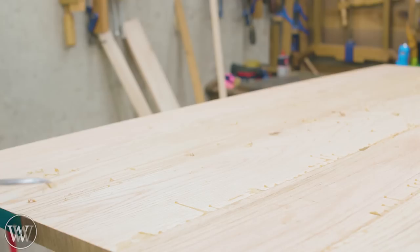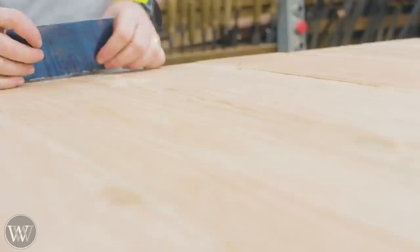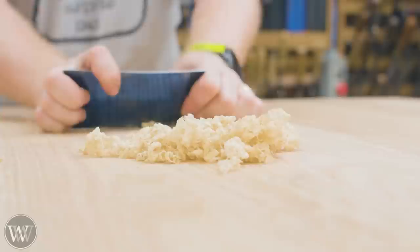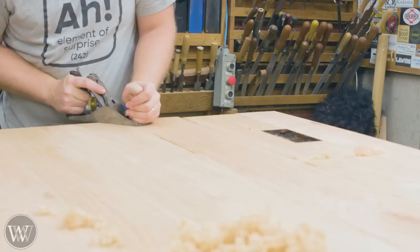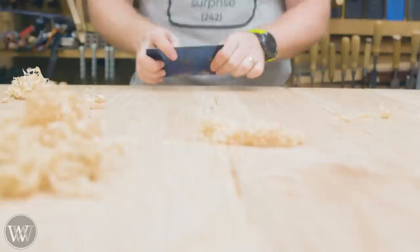Most of these are ready for a card scraper. A few are ever so slightly out of alignment so I'll bring a plane up for those. Then a lot of card scraper work - I'm going to go over the whole surface, particularly hitting the joints, smoothing everything out and getting any glue squeeze-out. The card scraper really comes into its own here. Some boards have grain going in one direction, some the other, and some switch grain direction halfway through - the card scraper really doesn't care which way the grain is going.